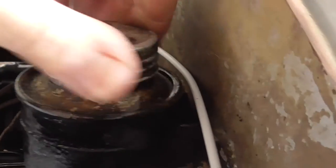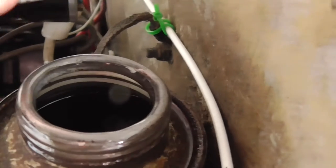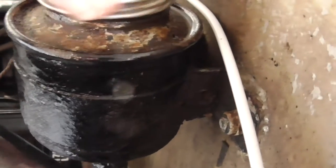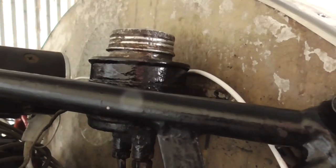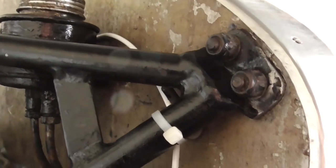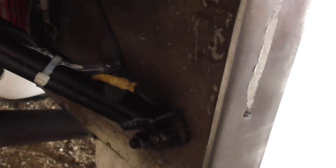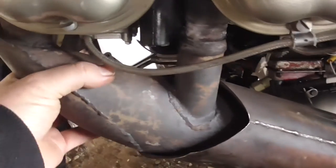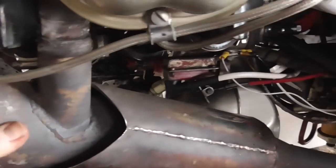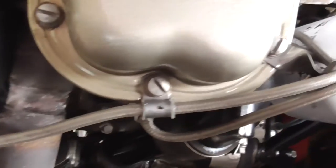Take the cap off the hydraulic brake reservoir — yep, that's fine. Seal that one up. From the brake fluid reservoir, I tend to check the condition of the engine mounts. And the other thing, while I'm here, always check the exhaust pipe, make sure that there are no cracks and it's secure, and check the condition of the gaskets.